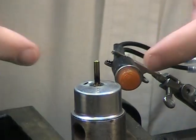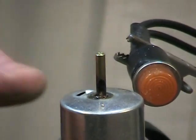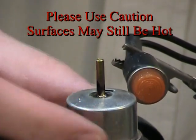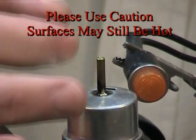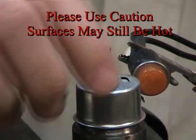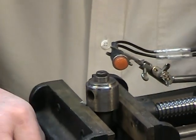I've got good flow — you can see it's nice and shiny, so I know I've got good solder flow. I know that they can't do this with that flame heating part, but I can actually touch this bell. My intense heat is localized enough that it's not going to saturate out and around that bell. It's a little warm, but it's not uncontrollably hot. So, there's the first one.